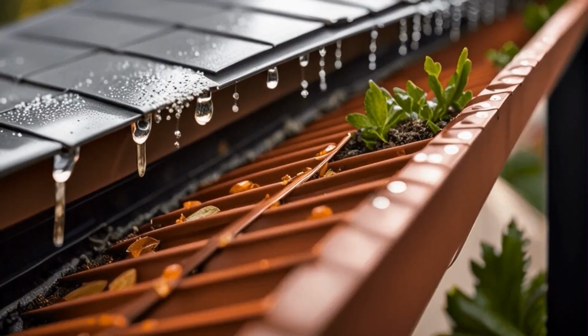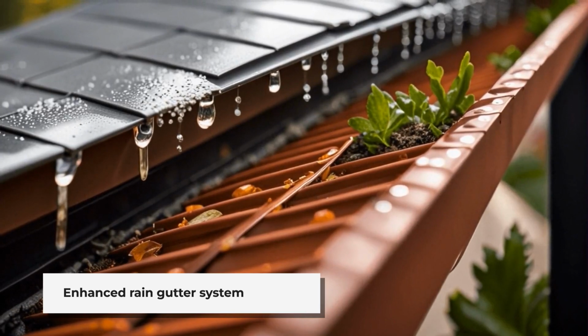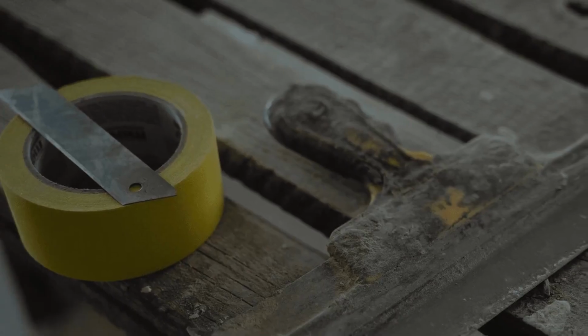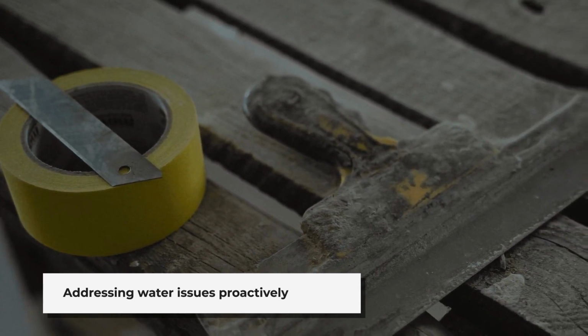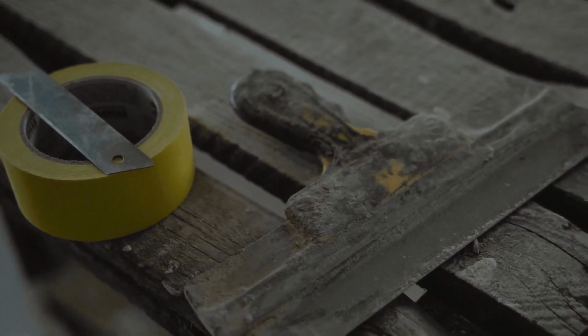Make sure that rain gutters on the roof are working and capable of accommodating the water from the roof. I added bigger, wider gutters in case it was happening. It would help. It was worth a little more time and some money. Besides the groundwater that I knew was coming in, the water coming off the roof could have been an issue too, and attributed to some of the problems in that area of the house.